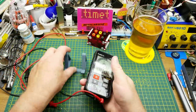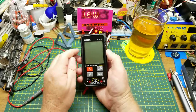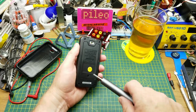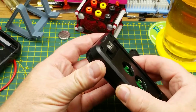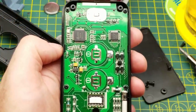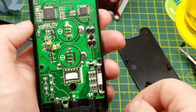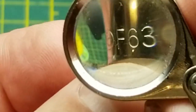Now let's pop it open and see what's inside. Four screws out, and the back slides straight off. There's the LED for the flashlight, and there's the fuse — the main reason most people would ever lift the back off. The fuse installed is a 630 milliamp, and the spares that came with it are also 630 milliamp — my memory about the 650 was off.